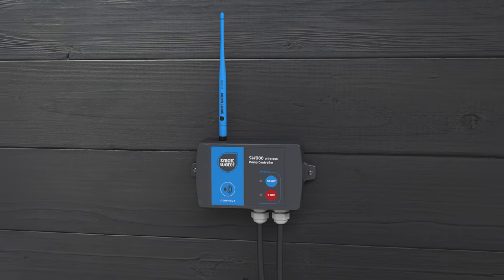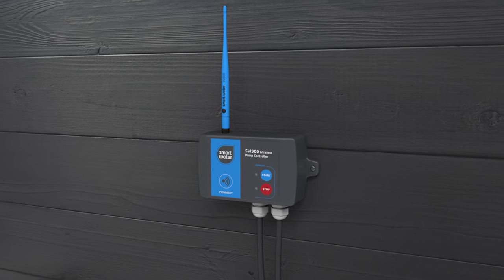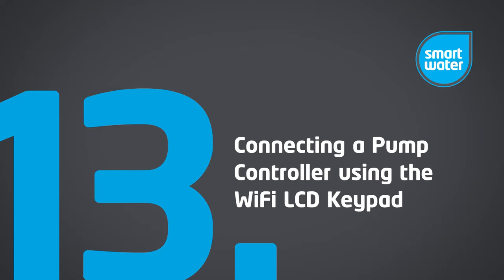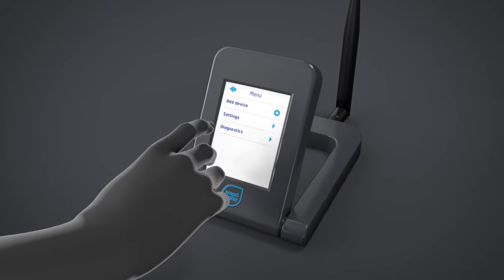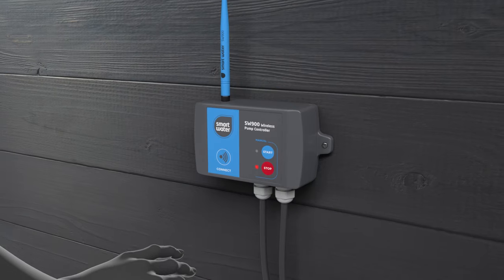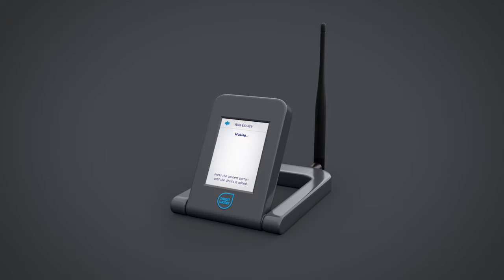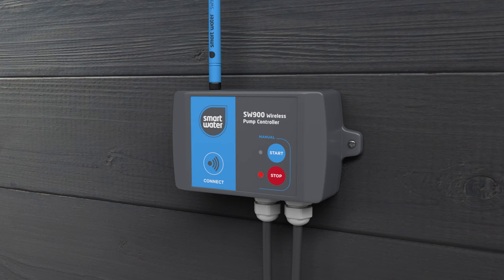SmartWater also offers a wireless pump controller as a further enhancement to your system, providing full wireless connectivity to control your pump. A comprehensive feature set is offered via the mobile app or WiFi LCD keypad, including both manual and automatic operation. The wireless pump controller is available in 230V AC, 12V DC and 12V DC changeover versions. To connect the pump controller using your WiFi LCD keypad, press the menu icon then select Add Device. Hold the blue connect button on the front of the pump controller. The LCD keypad will beep and display Pump Added, and the pump controller's start button LED will blink green as confirmation. SmartWater recommends connecting all pumps to the system prior to physical installation.